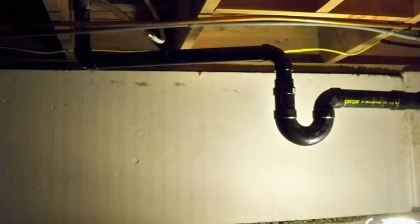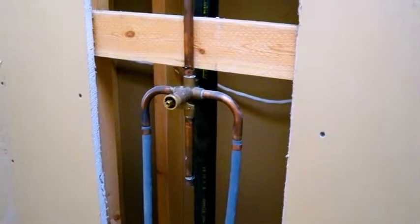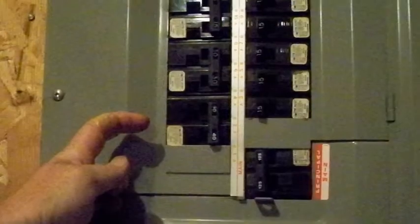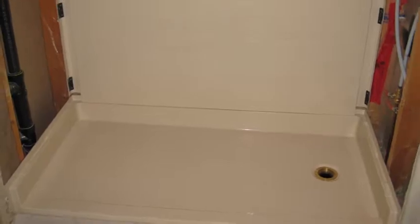Perhaps the most challenging part would be the plumbing and electrical connections. So if you're not comfortable with making simple plumbing connections involving flexible piping and shark bite connectors instead of soldering, or if you don't have a dedicated 20 amp circuit on a GFI available for use already, then you may want to hire a plumber and electrician to finish those details. But overall, the installation itself should be able to be handled by any handy person.